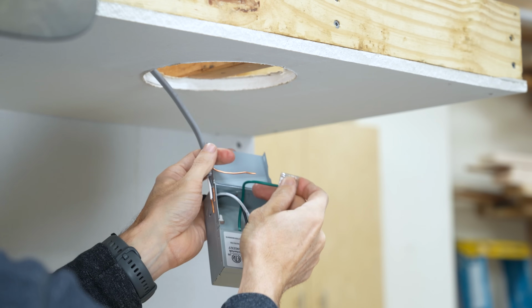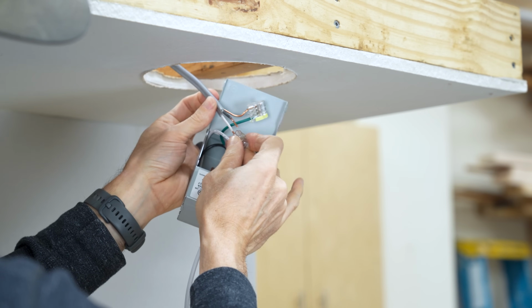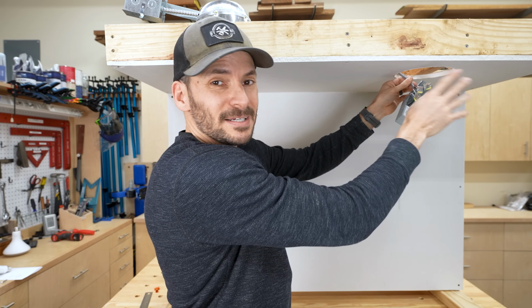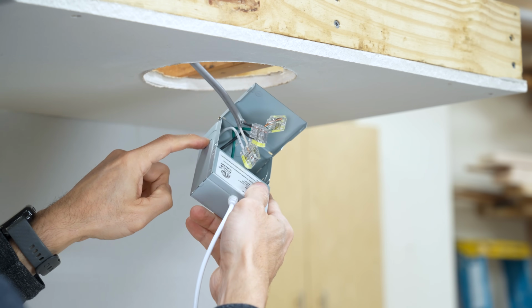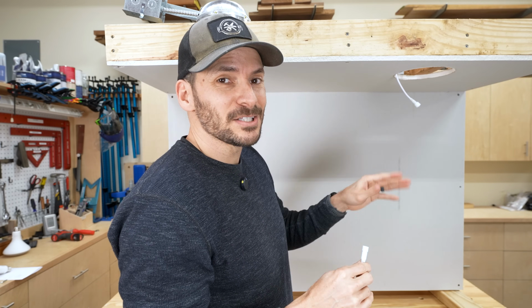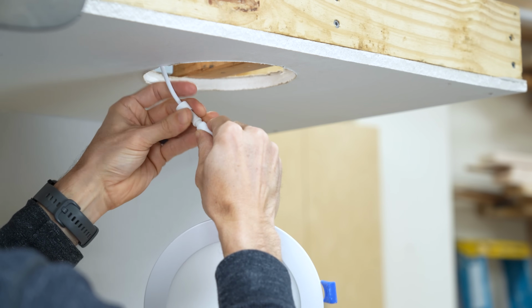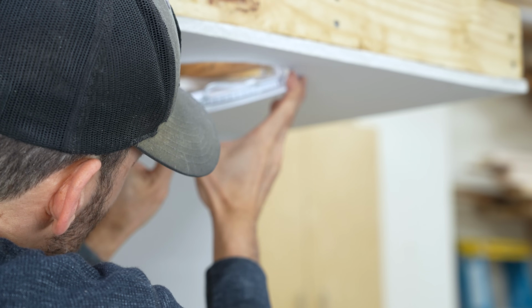So I can just reach up here. I'm going to connect green to ground, do white to neutral. And these do have 4 different slots here, so you could put an extra wire in. So if you're daisy chaining, you just put the next wire into the same of these locking nuts. Makes it super easy. Then you just run down to the next light. Now, of course, this would go through the punch out. I'm not going to do that because I'm not really installing it right here. But I'm just going to tuck this back up in there. I'm going to show you how to do the actual install in a future video where I'm putting those in FTBT HQ2. But for right now, for demonstration purposes, we're just going to keep it like this. Then all we have to do is put in our little connector, and your wiring's done. You can put it in the ceiling.